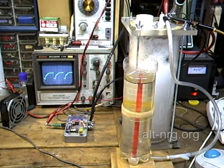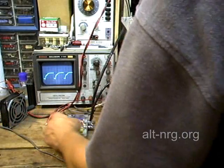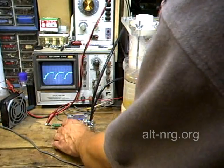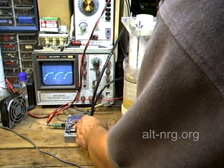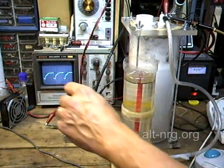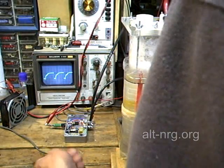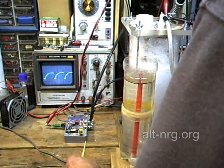The device has been running for about thirty minutes now. I did have to put a cooling fan blowing across it, and I'm going to add a CPU cooling fan on the opposite side in the finished product. One thing I noticed is that as the case temperature heats up, the oscillator timing capacitor — the 0.022 microfarad timing capacitor — has a negative temperature coefficient, so the frequency was going up. When I put the fan on, the frequency dropped again. I want to keep it around 2500 to 3000 Hz; that's where it seems to sing nicely.